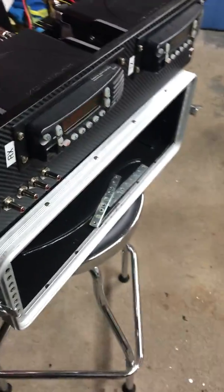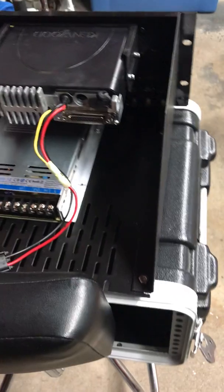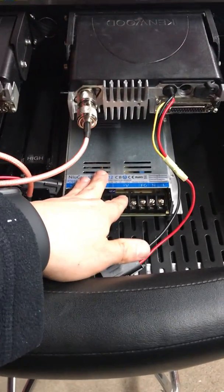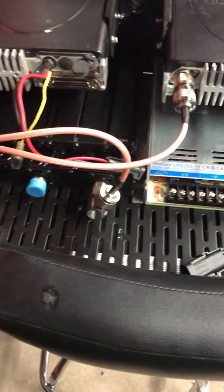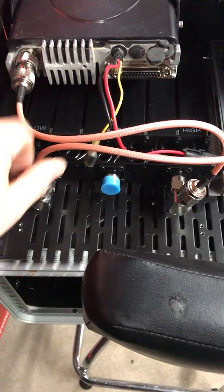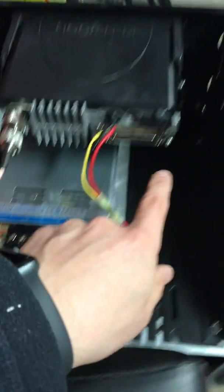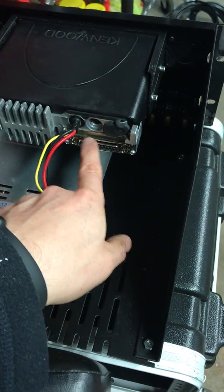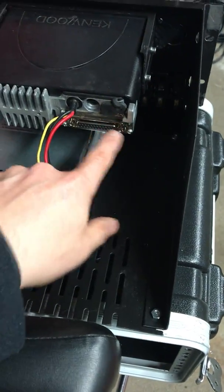This is attached to a 3U shelf, as you can see here. On the back we have a power supply to power both the radios and the repeater controller, which is not present yet but will be. We also have the antenna duplexer here. At this point I have to wire in all the power and then the controller. I've already built the harnesses to connect to the controller — I just have to install those.